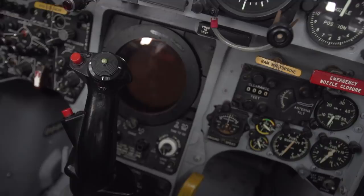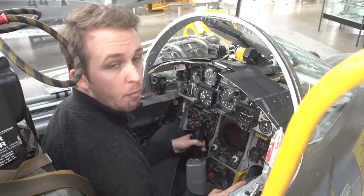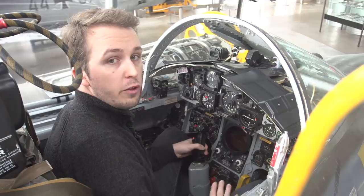Below the radar scope would be the controls for what you would be seeing on it — so you have 10 miles, 20 miles, 30 and 40 miles, and with the indicators on the radar scope you could then measure the range to your target. For the radar, generally the search cone is 90 degrees, although that could be limited in track mode if you wanted to.